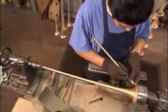They roll the rim over even more to enclose the wire. Then they heat the rim and apply acid flux to clean the surface for soldering. Lead or silver solder ensures the wire won't rattle when the bell vibrates. After wiping off the excess flux, they put the bell back on the lathe and scrape off the excess solder. Using an abrasive sponge, they smooth away any scratches left by the scraper, then remove any solder bits trapped in the rim.